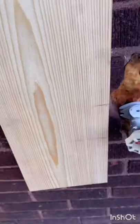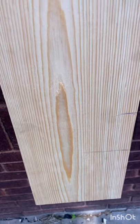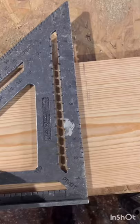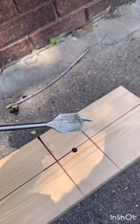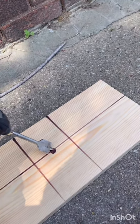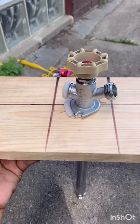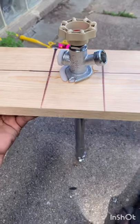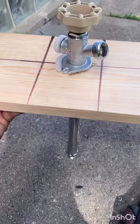I've got a rough estimate of how big of a space I need to work with and I took it out into my basement using my speed square to straighten up these lines. I measured and planned to drill an inch and a half hole to put the Silcock through. This is after I've drilled the hole using a speed borer bit, and dry fitting to make sure that the spigot fits through.